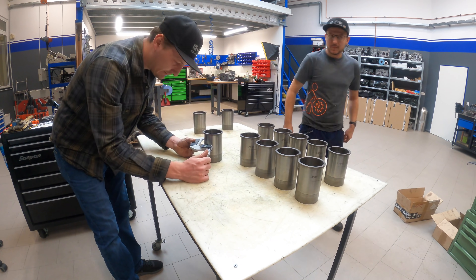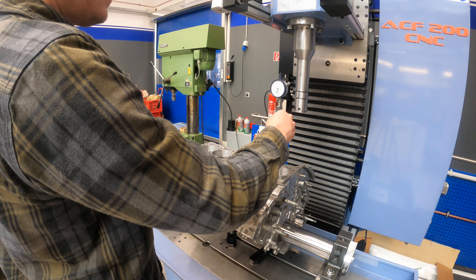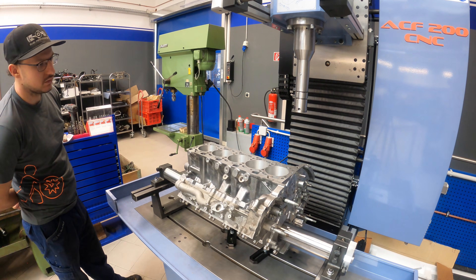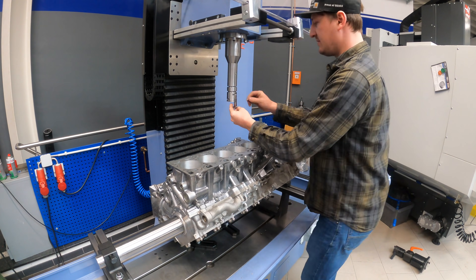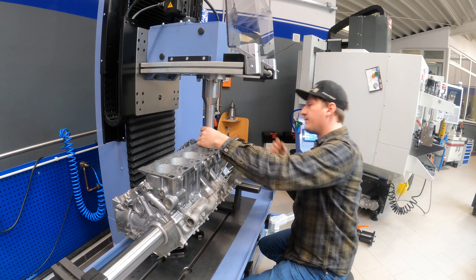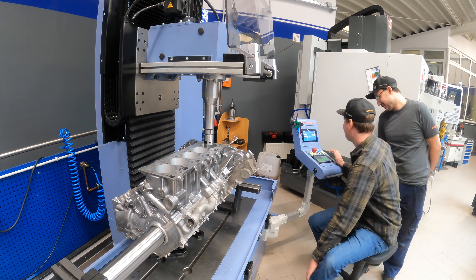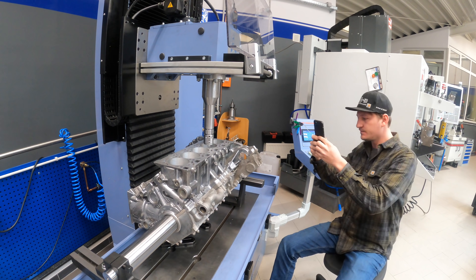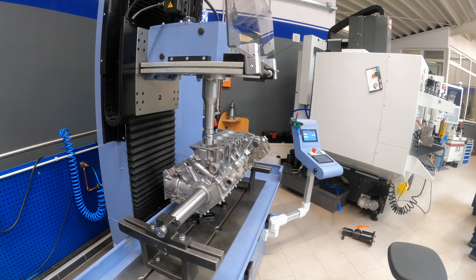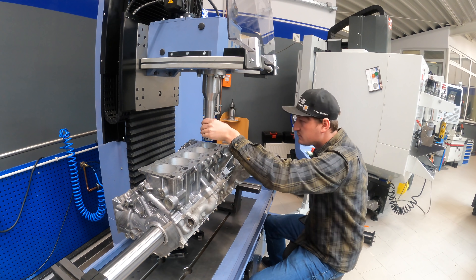I check the sleeves — they are made very well, made in Germany. Now I check the cylinder bore to know how much I have to cut out. Then I start to locate all the centers of the cylinder bores. This is a CNC machine so it does it fully automatically — I only have to input the bore distance and the bore diameter. That works super fast and it is much more accurate. Now I install the cutting tool.